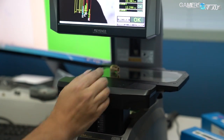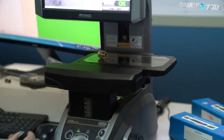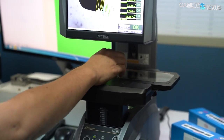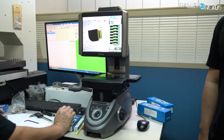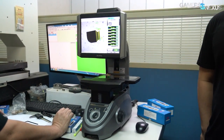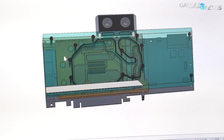In this instance, a fitting is being checked for acceptable diameters and lengths. The machine has an error of 0.005mm, and the spec for acceptable manufacturing tolerance was barred from being shown on camera. But a technician cross-references the known guidance against what's shown on the screen, then passes or fails the component. There are a lot of trade secrets at these places so we can't always show everything, but they have guidelines that they follow.